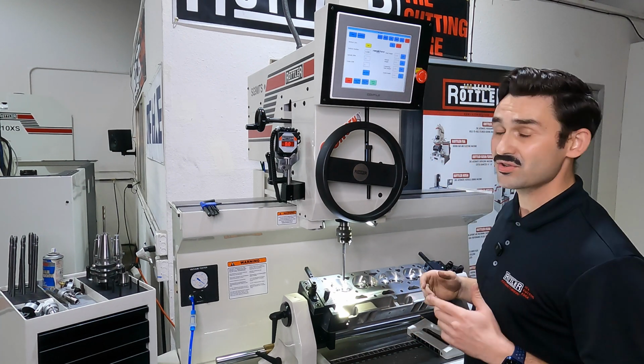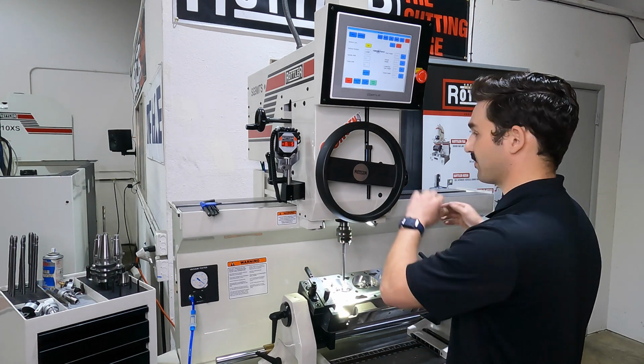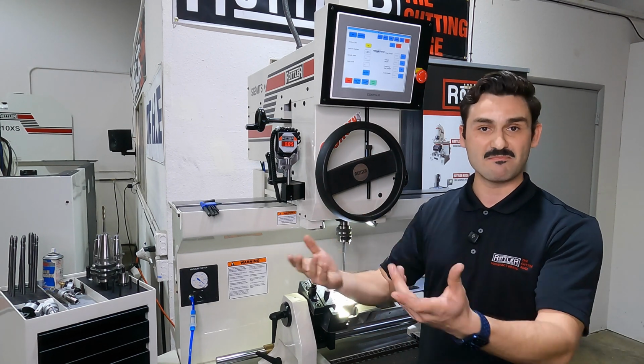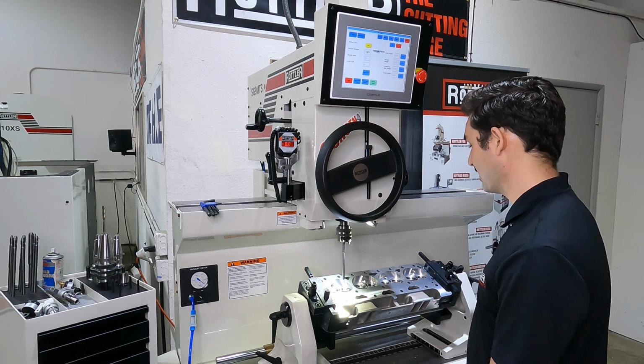What this lets me do is take my pilot out and float the workhead all the way over, and then as an operator I can just run this to the hard stop, all the way retracted, and it'll park it over there. If I'm batching heads and I just want to load the next one, that gives me a nice area to just sit for a little bit.